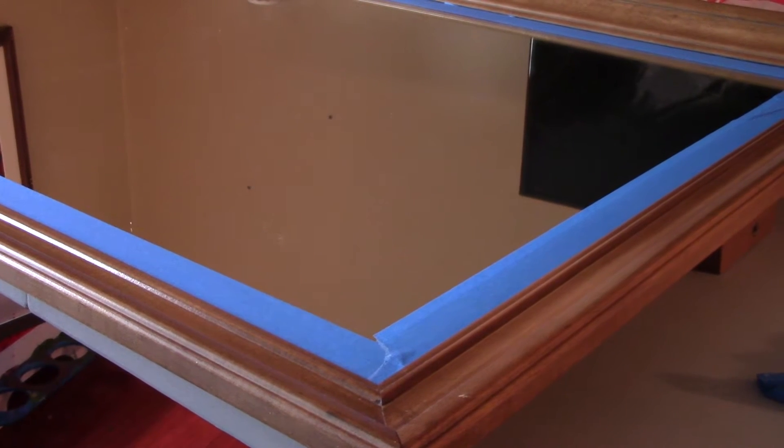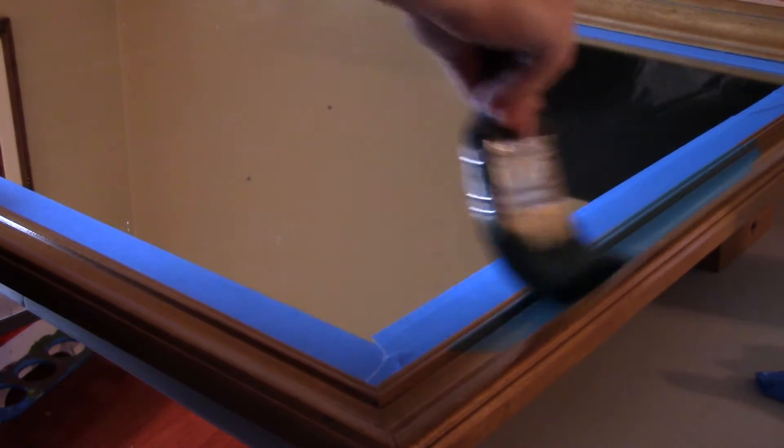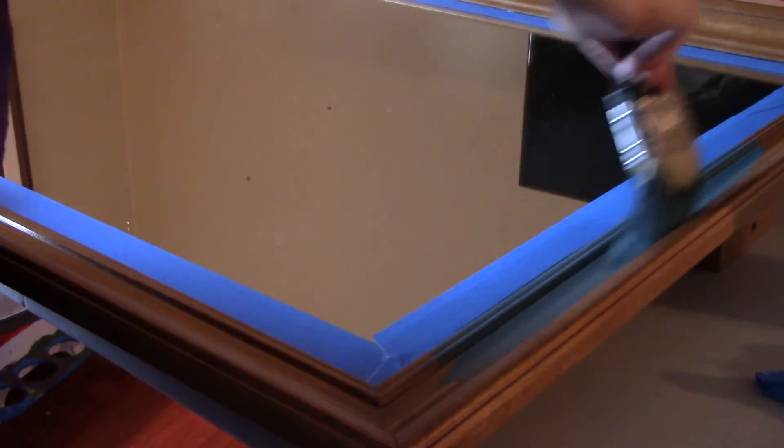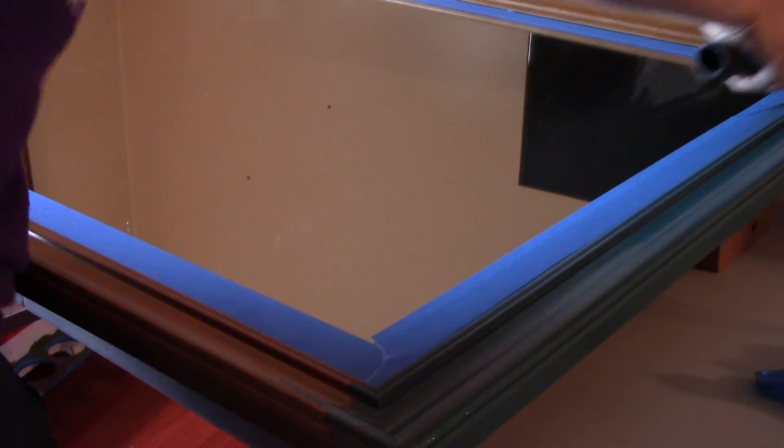When I worked on the mirror, I did things a little bit differently. Normally I don't tape — I have a pretty steady hand from lots of practice cutting in without tape. But for this instance, I wanted to also be able to use the roller to get that nice smooth look, and I wanted to just brush around without worrying about it. So I took my painters tape and snugged it underneath the lip where the wood meets the mirror. Then I was able to go through and paint over it with my brush first and then smooth everything out with a roller. I did just the top and sides of the mirror since it's going to be against the wall.